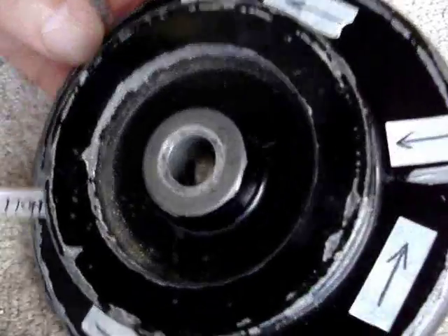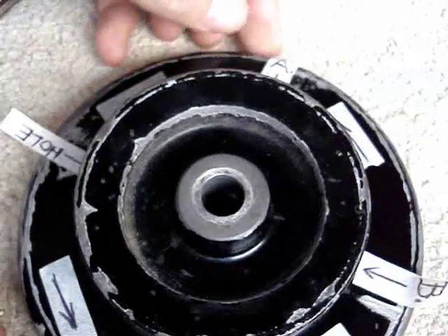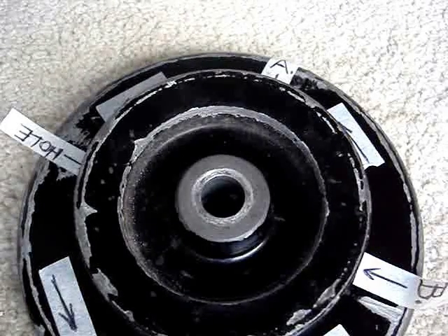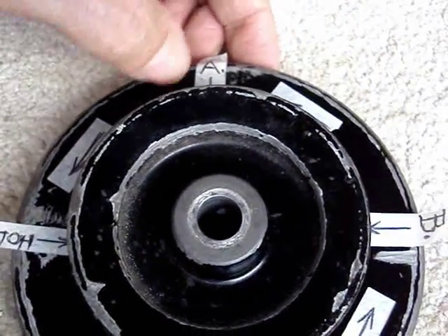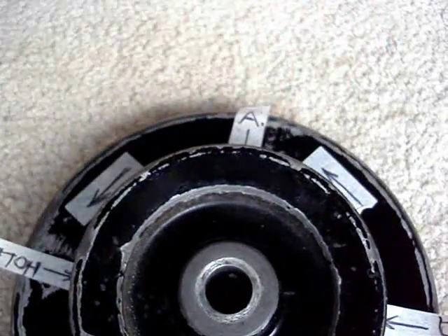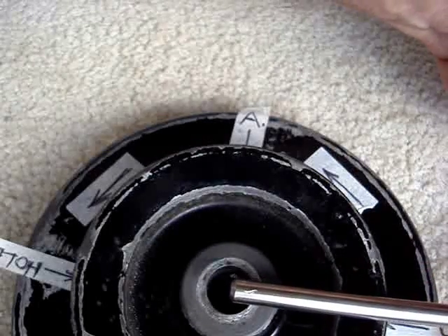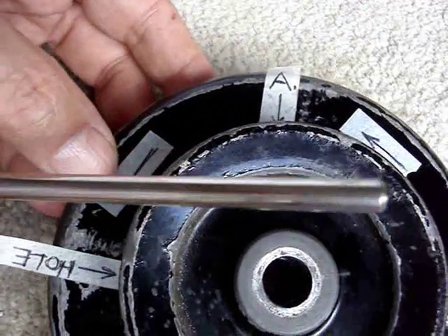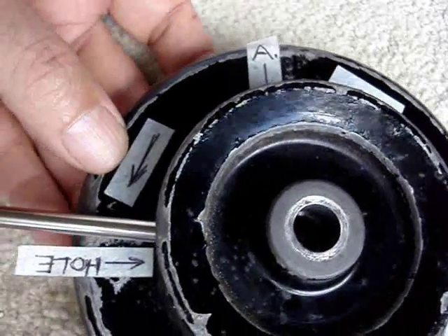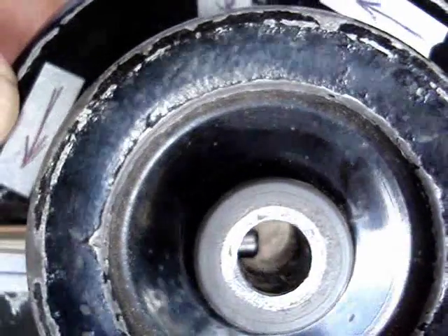Here's the hand wheel off of my console 226. I was going to remake this thing because it's got some problems. Number one: it's got three holes for set screws but only two set screws came out. I call them set screw A, which comes in approximately like this, and set screw B on the right. There's a piece of rod — metric actually — and I'm going to shove it in from the left and watch the bore. See that? It goes right through there.